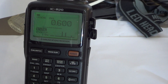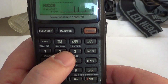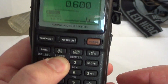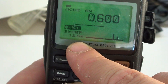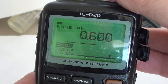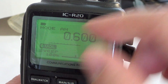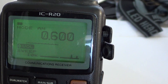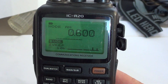To choose the tuning step for the scope, press and hold the number two button, which has 'sweep' printed above it. Then use the right dial button on the top to change the step. You can see it's currently at 12.5 kHz — with the right dial I can change it to 10 or 9 kHz depending on what I need. The lowest step size is 1 kHz and the highest is 100 kHz. Since I'm in the medium-wave band, I'll choose 10 kHz.